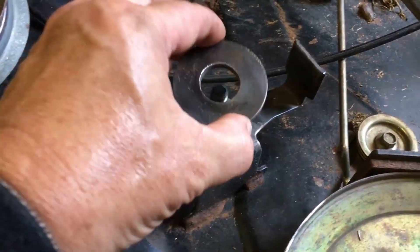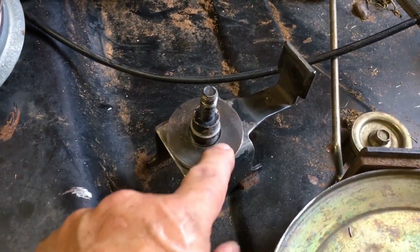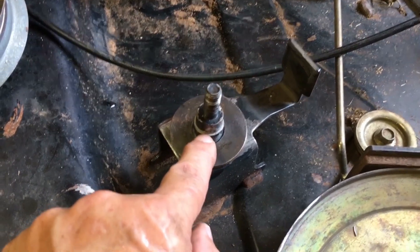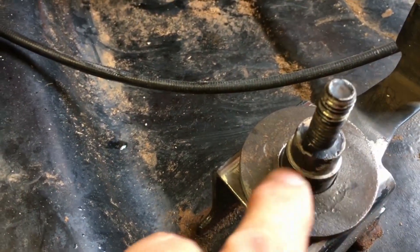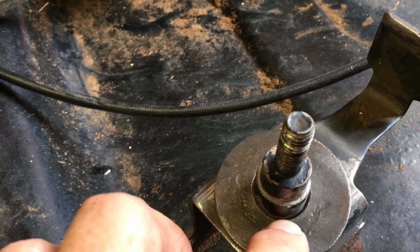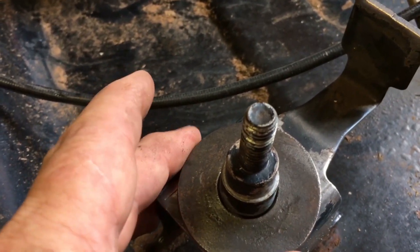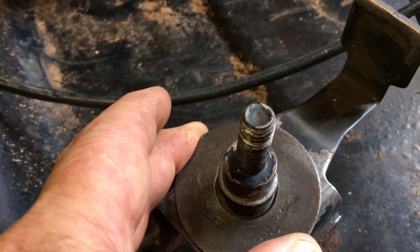So instead of doing that, I'll put this on there. I have the clearance — when the pulley goes down on it, it's not touching this washer. The pulley bottoms out at a step — you can see there's a step, then a step, then up. The pulley's not going to go all the way down there anyway, so I'm good. I'm going to tack it before I really weld it hard and good, but I think that's going to do it for me.